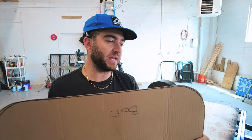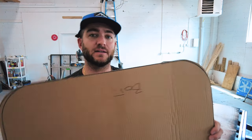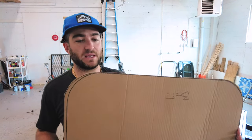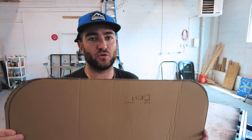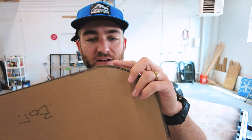Something to keep in mind when cutting in your doors is that you actually want to make the opening a little bigger than the door itself. If you make it just the right size, it's going to be hard to get in there, and you might need to maneuver things to make sure it's level, straight, and plumb. So I'm going to cut it a little bigger than my template — just to give myself some wiggle room. The door has a trim of about an inch and a half, so there's a ton of wiggle room if the hole's too big — it's really going to be okay.